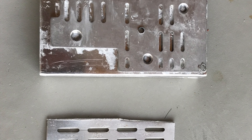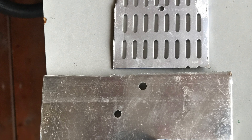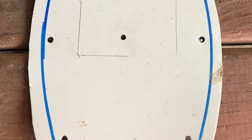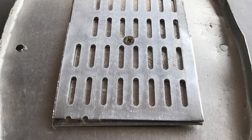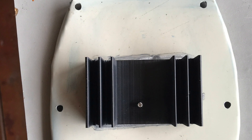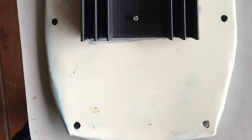I have two pieces of old electronic heat sinks, with one attached to the original aluminum sheet. Here I have another small piece of aluminum cut to the size of the second heat sink on top. I trace the back cover onto that sheet of aluminum with the border, then cut it to size. I remove the paint around the area of the heat sink for better contact. I attach the two pieces of aluminum to the new back cover, and the black heat sink on the outside of the new back cover. Then I put back the original heat sink with the new piece of aluminum. This is a new aluminum back cover with additional heat sink — when I close the cover it will touch the original heat sink and transfer the heat to the outside.